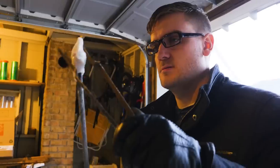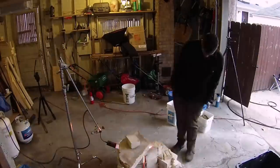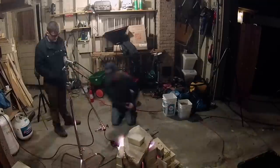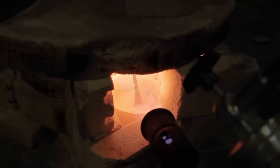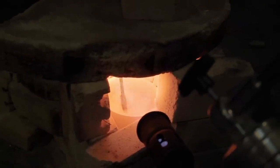After waiting a few hours for the kiln to reach the right temperature, I mixed together the three ingredients and added them to the kiln. After a while, the glass started to melt and turned into a thick liquid. One thing we noted from my first attempt was that the glass lower in the crucible was actually a lot clearer than the top portion. We suspected the potash had sunk to the bottom, so to counteract this, we made sure to mix the glass periodically.